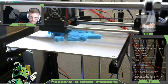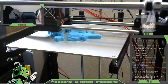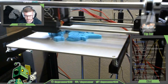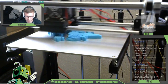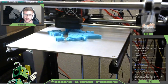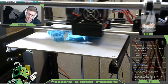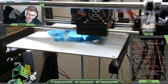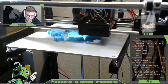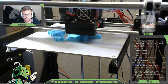Hey man, I'm gonna buy my first kit for building a 3D printer. What one would you suggest? It depends, man. It depends on a couple things. So, one is gonna be budget, like how much you're wanting to spend. Two, what materials do you want to print in? Because there's a lot of different plastics. How large do you want to be able to print, size-wise? And then whether you feel comfortable building a kit printer or not.